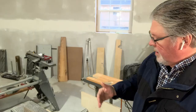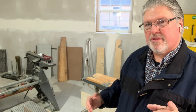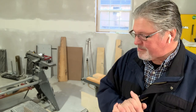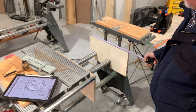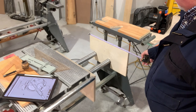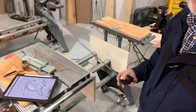With my table installed and my extension table in place, I've got about 22 and a half inches that this top could be. The manual doesn't give me the overall dimensions of the saw. Based on the dimensions of my Hitachi saw, which I hope are close to the saw I've ordered, I've set the height to allow the saw to sit here and still have the tables work with the main table at its lowest point clearing the saw. As for depth, these pieces are 18 inches. I plan on adding three quarters of an inch at the back, and I think I'm going to go with 22 inches in depth to give me the leeway I need.